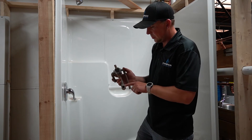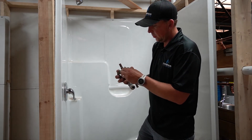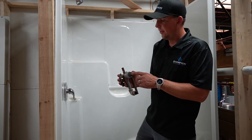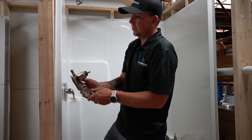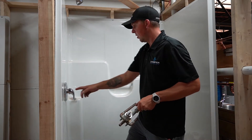Here's an older one I took out of a house. This was the tub spout — the galvanized old Delta. We can sometimes rebuild the seats and washers in them if we don't want to go into the wall, into the sheetrock or whatever your back wall is, to cut everything out and start over. So a lot of times we can replace these just like we did with this cartridge here.